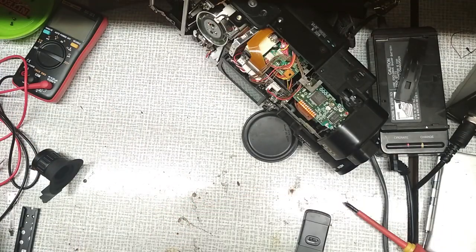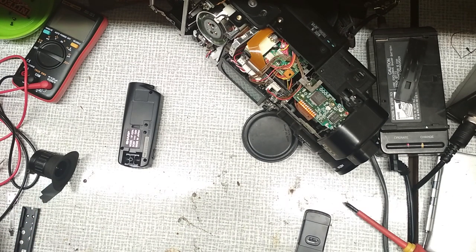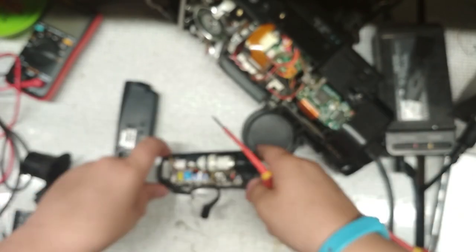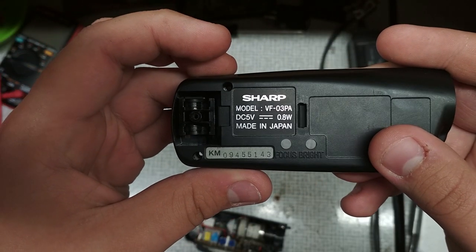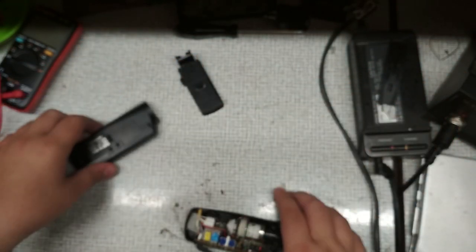Now that you have a viewfinder you'll need to remove all screws and open it up. From that point you'll need to be extremely careful because like a normal big CRT it might still be charged, which in the worst case can kill you. Most mini CRTs are powered with 5V so it's an ideal voltage for USB, but you need to check because there are also modules that need 12V.